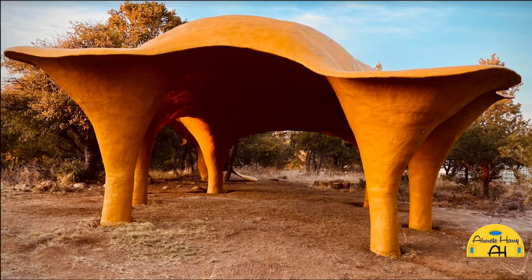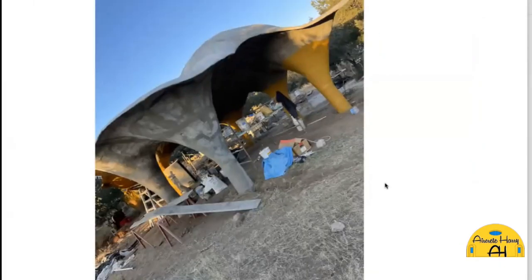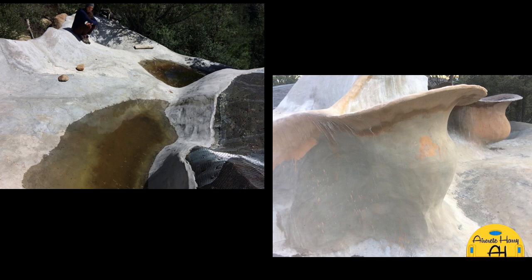Wow. Reinforced concrete design can be replaced with a thin shell design that uses high strength cement and a different kind of fabric reinforcing, like what I use. And then when you take that to the curvilinear design, where you're using curves to reduce cement even more by making stronger, lighter designs, you're really economizing the material quite a lot.